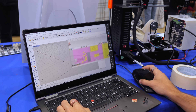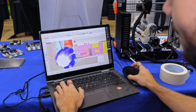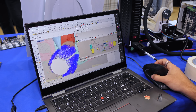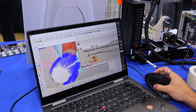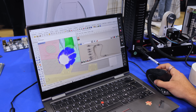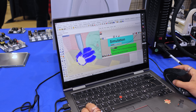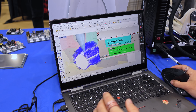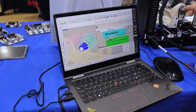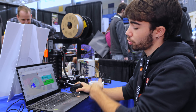Let me show you the Grasshopper definition — this is the slicer. Here is where you input the substrate, and then here I've got the paths. It's quite laggy because there are a lot of paths, but the key thing is that it shows the toolpaths, which is very important to avoid collisions. This geometry is mostly 90 degrees and then building on it, and the gantry in the simulation also rotates, so it's a good way of previewing it.